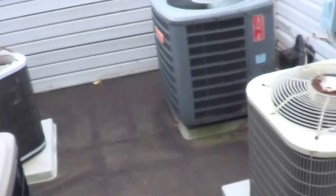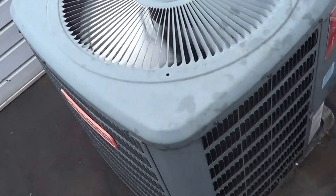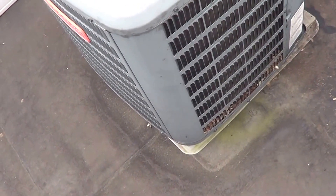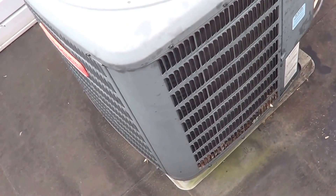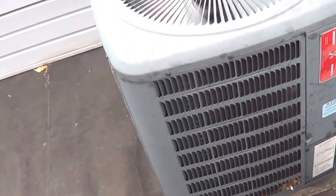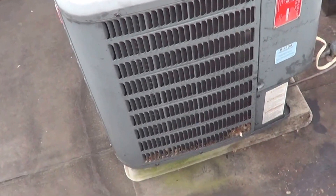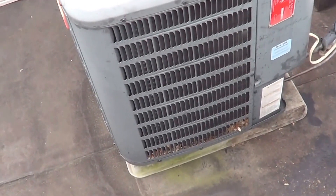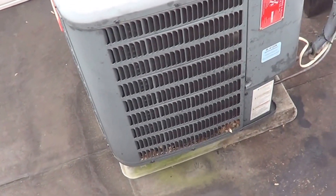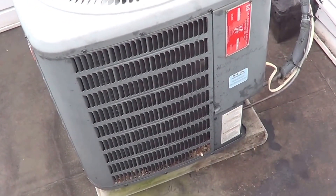Back to this unit — we have low capacity. It's a two-ton unit. I did a load calculation and it's only doing 3,000 BTU, so it's running at 15% capacity. I've also adjusted the refrigerant charge — it just lost cooling a day ago. The subcooling was up about 20 degrees, so I lowered the subcooling down to four degrees.